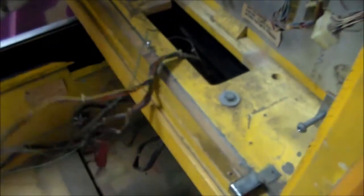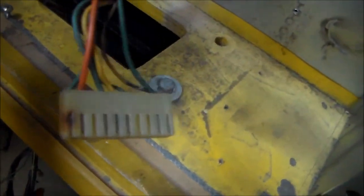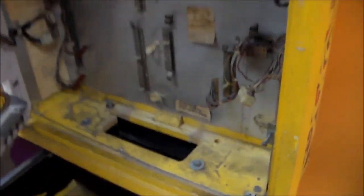There are about eight connectors total. Some of those would be on this harness — more of the cabinet wiring. Basically some of this will go up to the solenoid board, and some connections go to the cabinet switches. We'll get it all straightened out and figure out where it all goes. These three connectors here actually look pretty decent, although that one's burnt, so that connector will need to be replaced and re-pinned. So we're starting from scratch on this one basically.